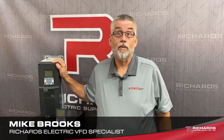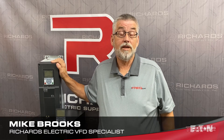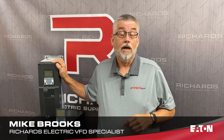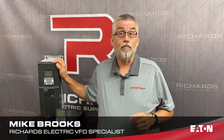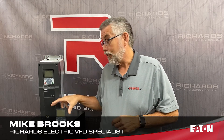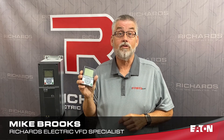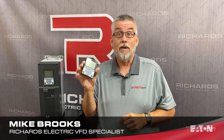In addition, the H-Max comes with a built-in 5% DC link choke and EMI filter, eliminating the need for a line reactor. An easy-to-use startup wizard with pre-programmed applications simplifies your startup. The graphic keypad allows you to quickly copy and paste applications to additional H-Max drives.